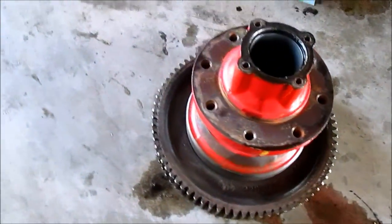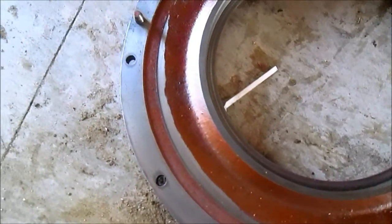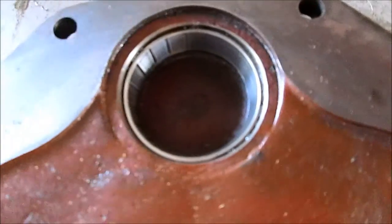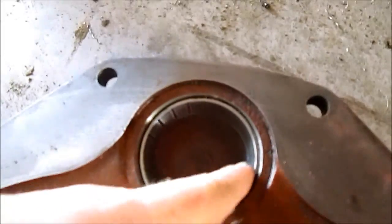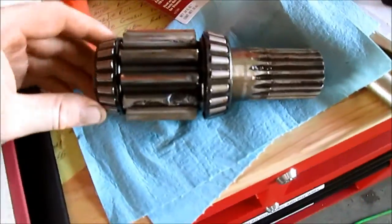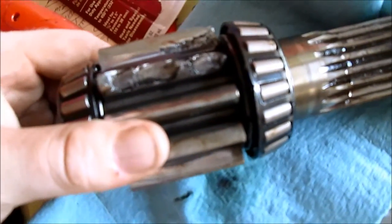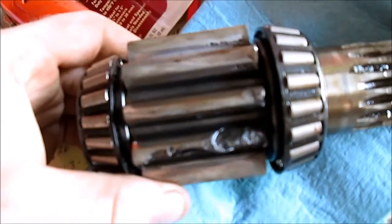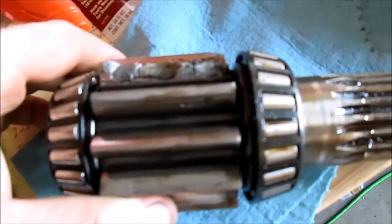Our ring gear is in excellent shape, but I found that this was rubbing the sidewall here, as you can see. And this bearing either had stopped — it's kind of odd, but it has these little grooves worn into this outer race here. I can get this, but I bought that 550 to use parts off of. And our major problem is this pinion gear here. Just in my experience working with metal, I would say this piece had some porosity problems when they cast it. You can see every one of these little teeth as you rotate it around — it probably had a nice finish on it from the factory, but that's what you run into when you're pouring steel of this magnitude and size. And then we lost this cog almost entirely.